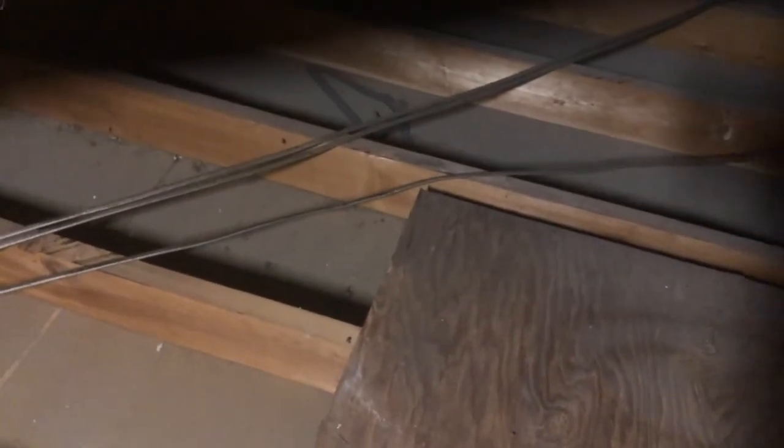This is over the garage. It goes way down there. All that storage. Except they used 2x6s. So because they used 2x6s, they're all sagging. Look, they used 2x6s on the roof rafters. So of course the roof is sagging too. See if I can show you the curl. It's a little hard with this. But if you go outside and look up, looks like there's a couple soup bowls on the roof. And we were wondering what the problem was, and now we know.